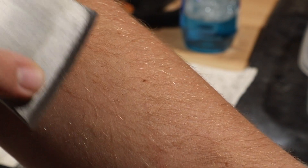After taking it through up to the 3000 grit, it is nigh shaving sharp. You can see it's taken off some of the nubbles up there, and I'm going to run this through on my leather strop to get that last little bit and then call it good.